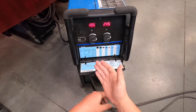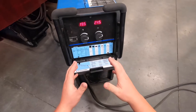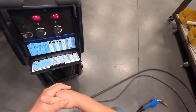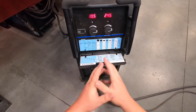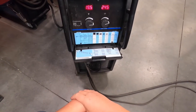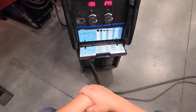For thinner plate, 19.5 volts and 245 wire feed speed is a roundabout okay spot for short circuit welding on thinner plate and some of your projects. That's just a starting point — it's not the gold standard. You've got to be right there. Everybody welds a little differently, so everybody's going to have a different spot they like to run their machine at.